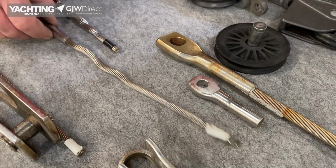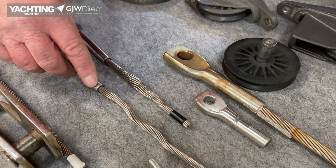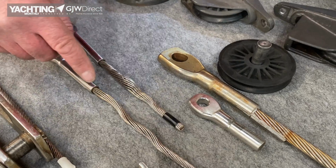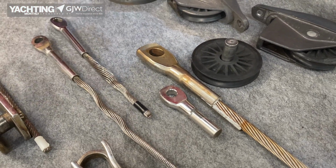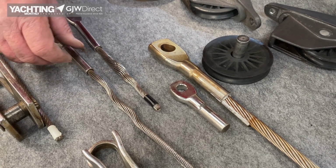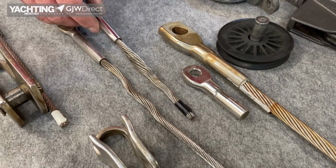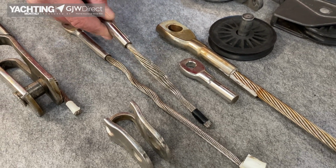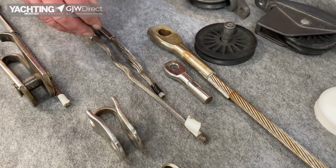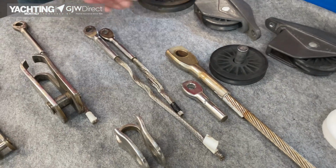We spoke earlier about forestays and the halyard leads. So this is what we call a halyard wrap, or what I would call a pig's tail, because it looks like a pig's tail. This has been caused by the halyard wrapping around the forestay and you pulling to furl, or putting it on a winch and keep going and keep going, and eventually you end up with this sort of thing. So that is condemned. That has to be changed and sorted out, and can usually be resolved by your lead from your slider to the mast.